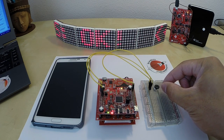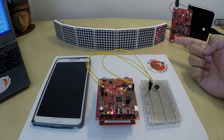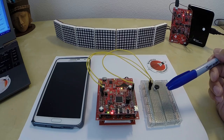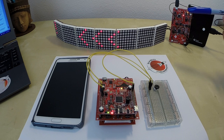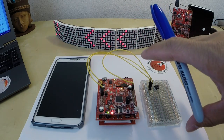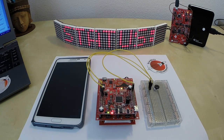But what's eventually going to happen is as I turn the potentiometer knob, that message is actually going to change from status-okay to alert, basically signifying to me remotely that the potentiometer value is at an, quote-unquote, unsafe threshold. So because these two things are physically next to each other, again, this is all going through Wi-Fi. So this Launchpad is actually MQTTing to the cloud, and this Launchpad is subscribed to that same exact MQTT broker. So even though they're physically located next to each other, this Launchpad could be on the other side of the world, connected to a Wi-Fi network, and we'd still be able to see the remote status update.